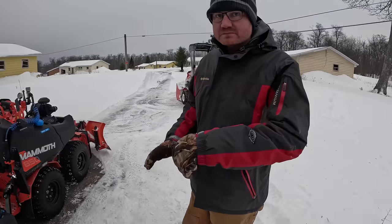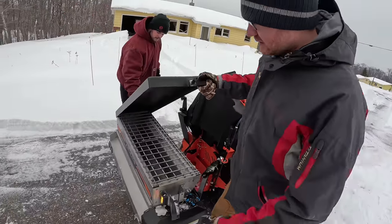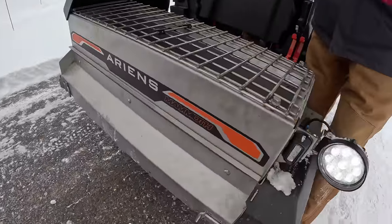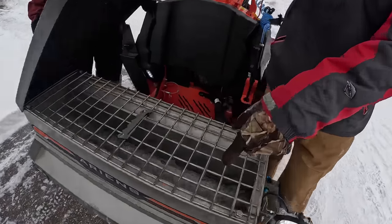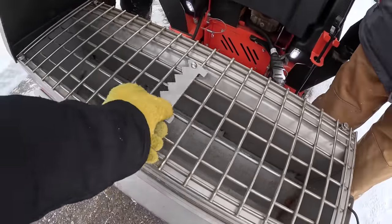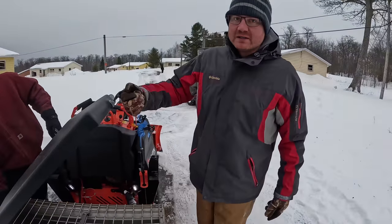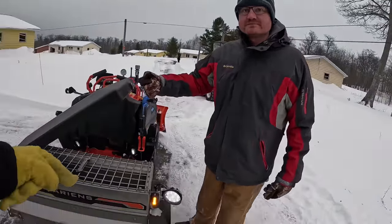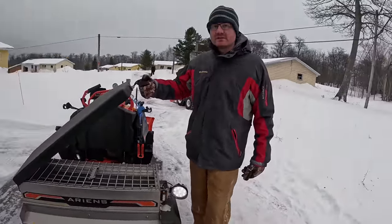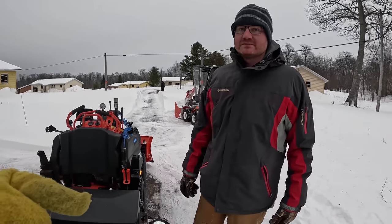So there's a built-in feature where this adjustment can go all the way down, and on the inside it'll interfere with the augers to help with clumping — there's a good declumping action going on. That allows the salt to fall down so you don't need a separate vibration kit on this unit. So intentionally, if somebody hears a clank coming from their unit, that's purposely built in to declump the salt. That's correct.